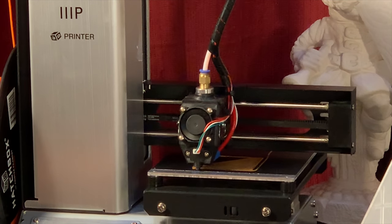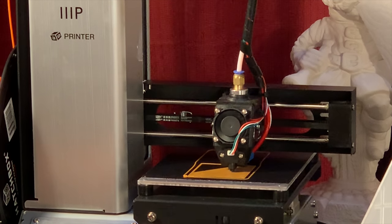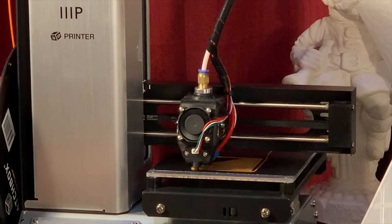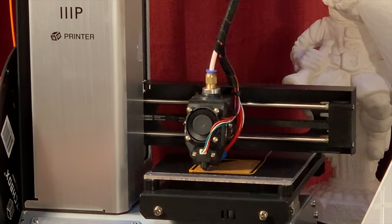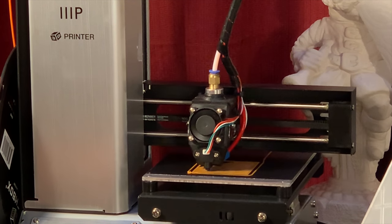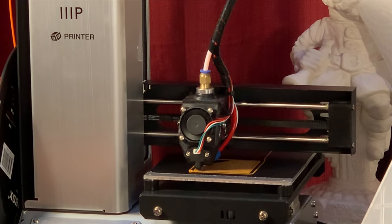I knew we were getting close, and this test print is looking really, really good. The skirt is sticking down, and the first piece of what would have been printed is sticking really nicely as well. I'm letting it go a little bit further than all the others, just to give it a fair chance. Once it's gotten a substantial amount of plastic laid down, I'll go ahead and cancel this print, peel everything off, and check the quality of the layers. If I think we've got it, I'll record this number as my offset from here moving forward.